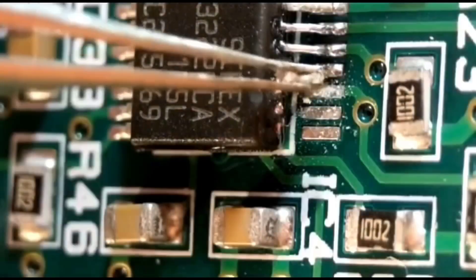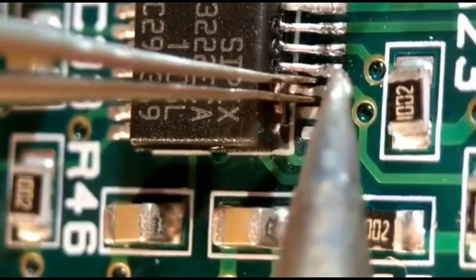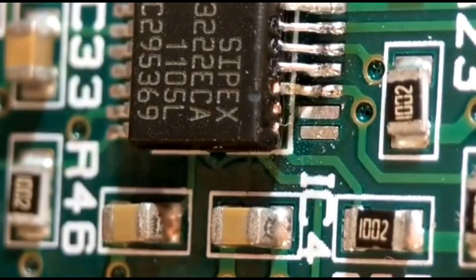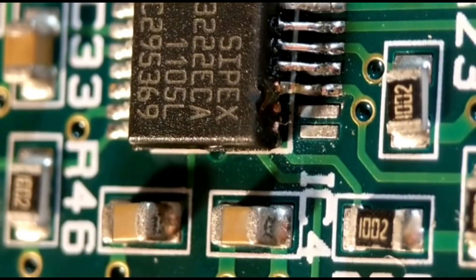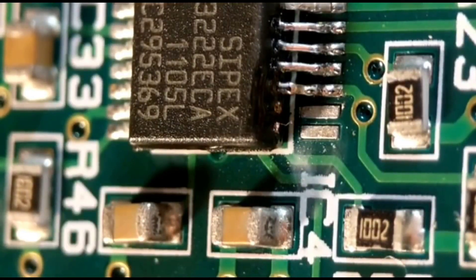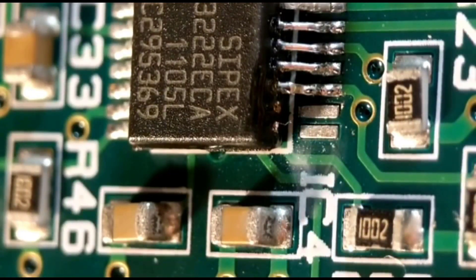Now I'm just going to attach the pin to the first of the three missing pins — just drop it into position. These are the ones taken off the other board. Tack that into position, then solder on the top same as before. Add a little bit of flux on the top. You've got to be really quick so the other end doesn't melt. Just a little bit on the top — there you go, a nice join top and bottom. I'll repeat the operation for the other two so it exactly matches the main pins. It's pretty much an invisible fix — no one will really know.